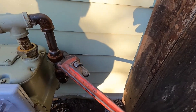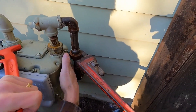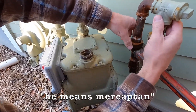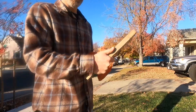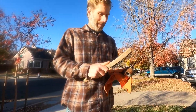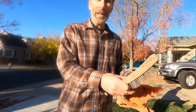I think I'm gonna have to take this off too. I can smell gas. If you're gonna paint something that was previously rusted, make sure you get as much of that rust off as you can. If you're spraying any of that soapy solution on there, wash that off as well, and dry it really good.